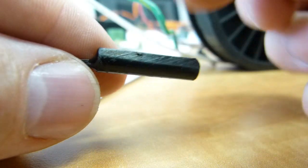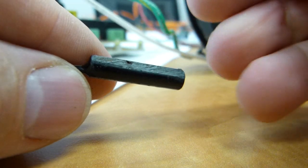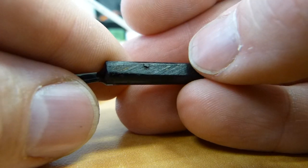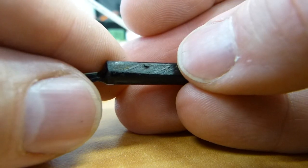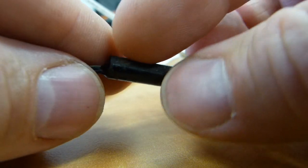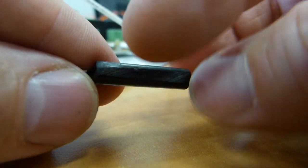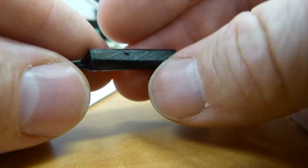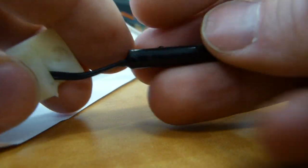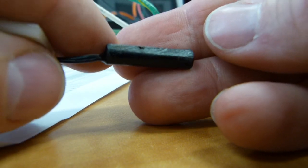When it is abraded even more, you'll see that inside there is a coil of wires. That coil of wires could be exposed and will remain fully functional unless one of the wires is broken on this coil, at which point this is going to stop functioning. Underneath the coil of wires there can be nothing, an air core, or there could be an iron core. Either way, this is what's inside. There are no moving components inside. This is what's meant by a solid state device.